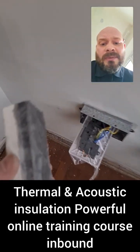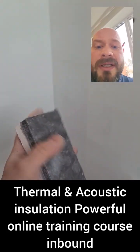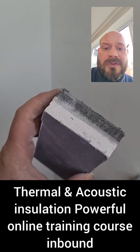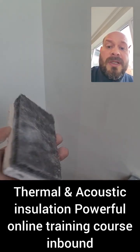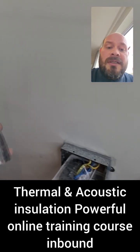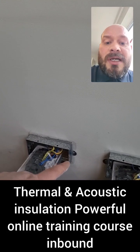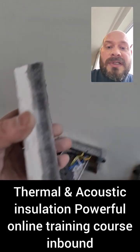This particular system is relatively simple to install. We can't bond it — they're just too heavy, they'd rip. They're 45 kg per panel; the 1.2 square metre panels are very dense and heavy. So we can't direct bond them, they have to be screw fixed.